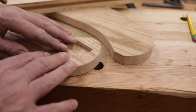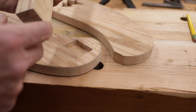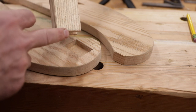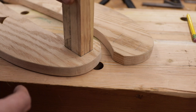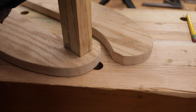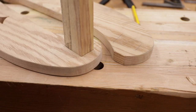I've got the first of the two mortises done here — I just did this one quickly to show you, and then we'll do the second one together. Whenever you're doing this kind of work, make sure you keep track — when you're hand planing material and not using jointed edges and planers, it's not super precise and each one needs to be kind of a custom fit. Let's see how it looks — it goes in there nicely. You can hear it seat. That's really great. It's in there three eighths or so.